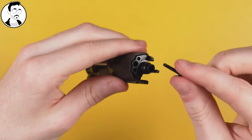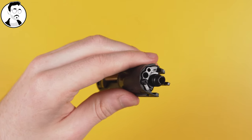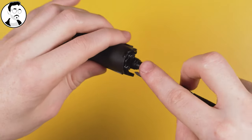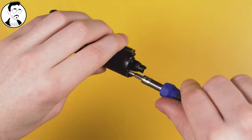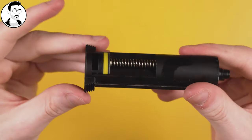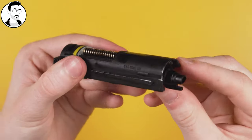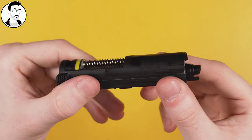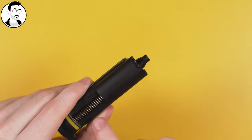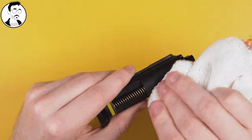Grab your carrier and align this nozzle spring with the small hole on the side — that's where it wants to go down, sitting on the small post of your nozzle. That's actually where the nozzle spring will sit on this tiny little post. Grab your screws and place them in the side holes — not the middle one, because that's where your guide rod will be going through. Just gently screw them in hand tight, nothing overly torqued.